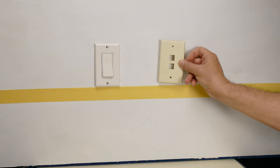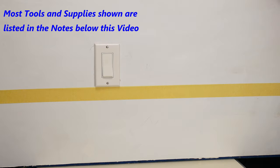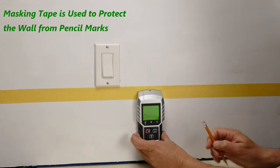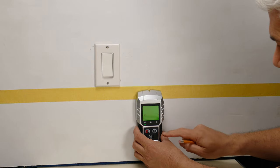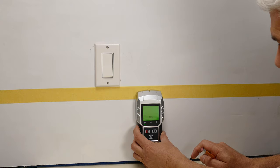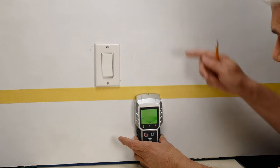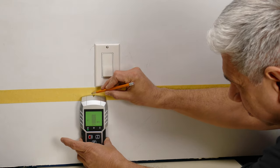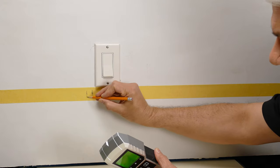I'd like to have this plate about here, but I have to make sure I know where the studs are. On this makeshift wall I can look at the top and tell, but I want to show you what I would do with the stud finder. I have my pencil and a stud finder and I'll go along here and pick a spot in the middle where I'm pretty sure there's no stud. You can tap the wall to get an idea of where the studs are. Let me synchronize it first. As I move from left to right there should be a stud generally wherever there's a power connector, whether it's a switch or an actual power outlet. And it shows that there's a stud right here — that's pretty close to the center of it.